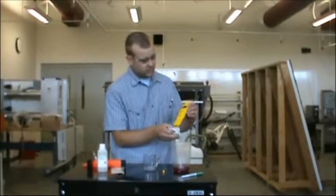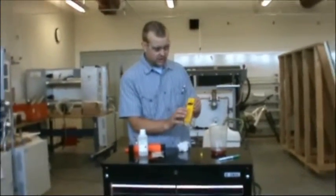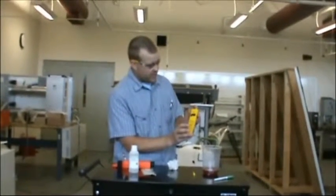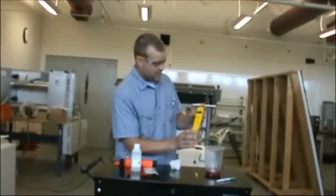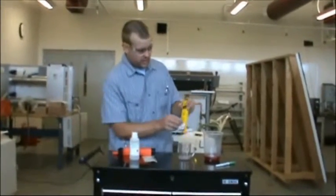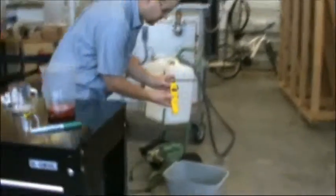So I'm going to clean this up gently, and now I'm going to make a measurement. Again, I'm just going to clean it off with my solution here, and I'm going to put it back. It should come back to 7.0, and it has. It's come back to 7.0, and now I'm going to re-clean it. So this time, turn that off, and I'm going to measure my solar fluid that we're going to install in our system. So I'm just going to take a small sample.